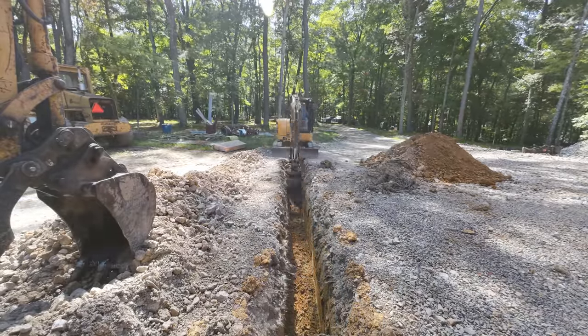So as I mentioned at the beginning of the video, this is a very long run from the power. It's over 2,000 feet from the nearest power source, i.e. telephone pole, to where my transformer is going to go, where it'll switch that high voltage power to low voltage power for the building. I knew from the get-go this was not going to be a cheap undertaking. I did not prepare for quite how expensive this is getting though. I have over $12,000, I think it's $12,200 exactly, invested in just conduit for this project. That's 3-inch schedule 40. I used 2,500 feet of conduit for the primary feed and a couple sub feeds off of that, one for my building and a couple for the neighbor's building.